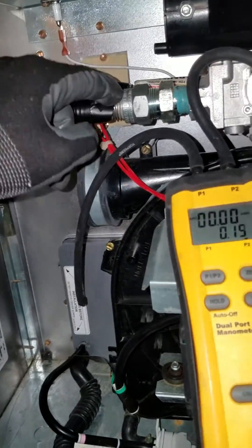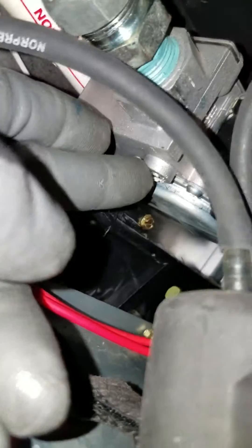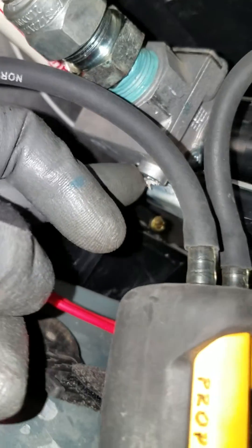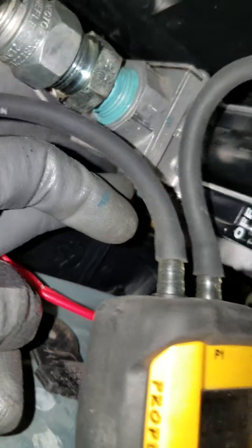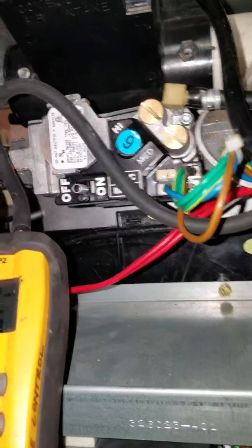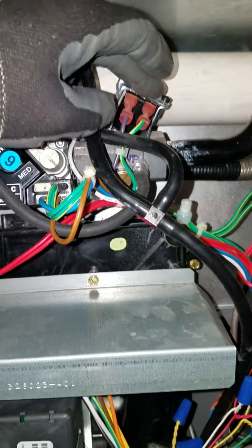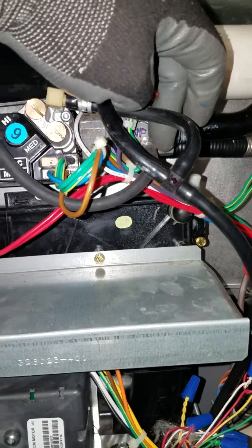After the inlet there is a port — right here. There's a port there for inlet gas pressure, and then there's another port there to check just that two-stage gas valve. For a three-stage gas valve, this is what makes the third stage. You want to check after the third stage gas valve.